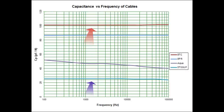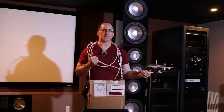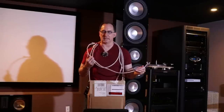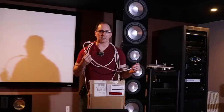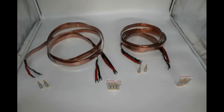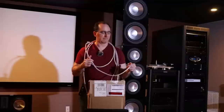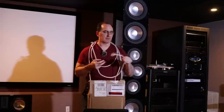This is a well-engineered cable. The capacitance is about four times higher than regular zip cord, but that shouldn't be much of a problem with today's modern amplifiers. With good matching on your speakers and good crossovers, you should be okay. I've never had a problem with this cable causing any type of oscillations. It's not a super-high-capacitance cable — more like 100 picofarads per foot, which is pretty reasonable.